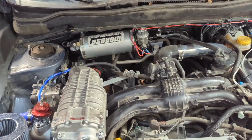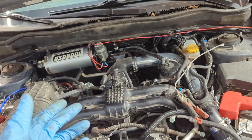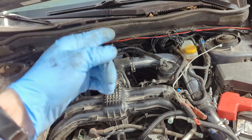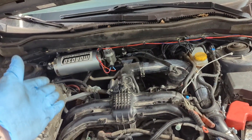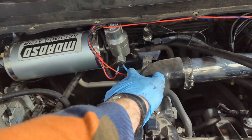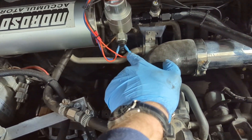So that's one thing you might want to do — a switch. The other nice thing to do is an indicator light or LED of some sort to show you in the cabin when the AccuSump system is discharging. Basically, it's the same system with switched ignition power behind that arming switch.